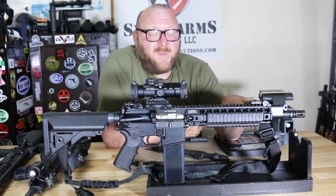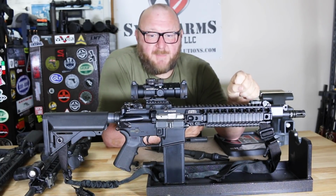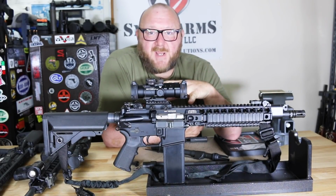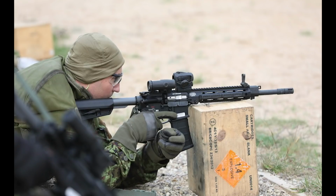It will have nothing to do with the heat of the bolt carrier. It will have nothing to do with anything else. The barrel will hit transformation temperature, and the barrel will blow. The gas systems will last just as long. These are properly made mil-spec gas tubes for the internal piston, so your barrel's going to go before the gas tube does. So overall, I think Estonia got themselves one hell of a rifle.